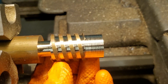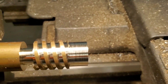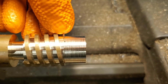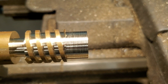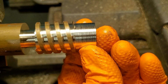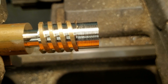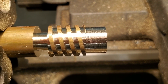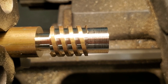That's my thread all done. I'll measure the second thread as well, and I'll actually measure them at the same time — I'll do that off camera. The only thing left to do will be to deburr the ends. I'll just get a file and round over this paper-thin little burr at the beginning and end of each of the threads, and then I'll take it over to the mill and machine the five-eighths square on the end — after I part it off, of course. I hope you found this video helpful. If you did, please consider hitting like and subscribe down below. Check out my Patreon page as well, the link's down in the description. Thanks for watching, and I'll see you next time.